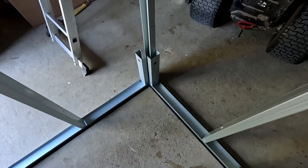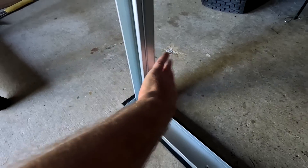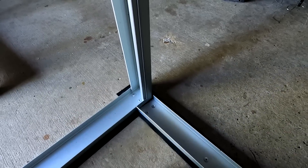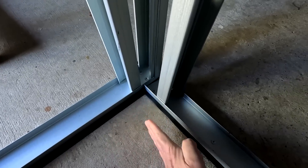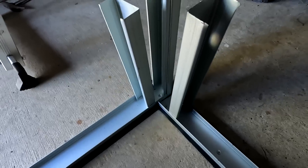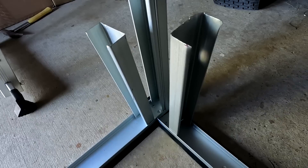I'm a bit unsure how to form this corner from the inside of the room. The outside boards have support from this stud, but the inside boards have no support here. So I would need to put another stud in here, and also another stud somewhere in here, so these boards on the inside can lean against it. It's probably not the best way to build an outside corner — I should have watched a YouTube video. But now I'm two studs short.